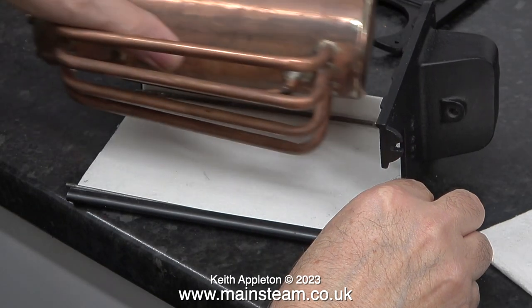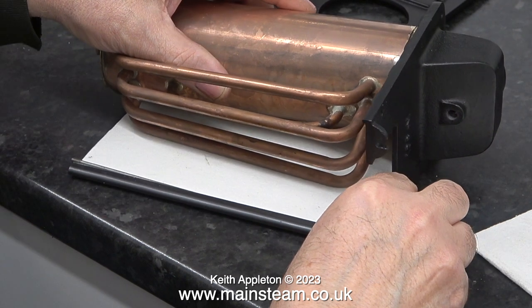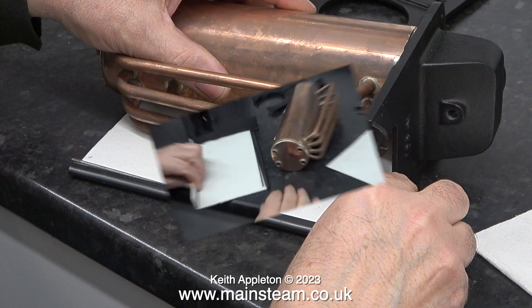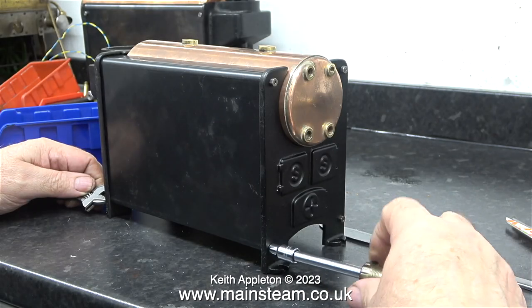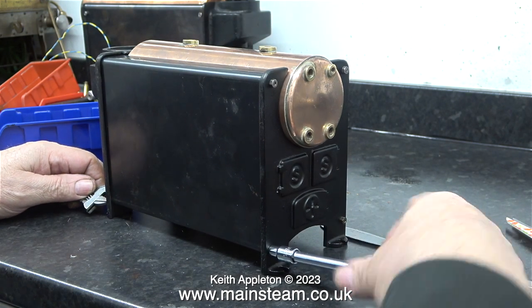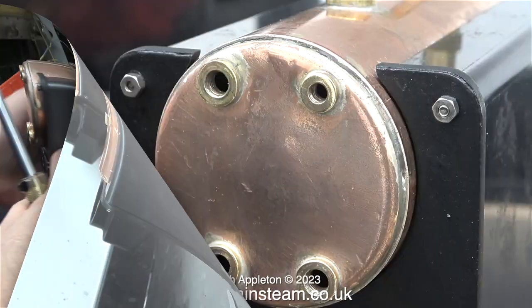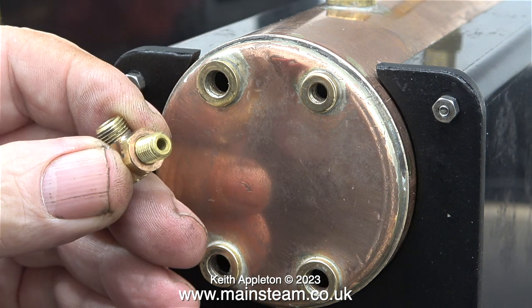The sides of this boiler are anodized, so they're fairly heat resistant to start with, but I'm fitting some heat insulation as well. This is the modern-day safe equivalent of asbestos — I think it's made from china clay. Once the boiler was loosely assembled I tightened each of the nuts to pull the end plates tight up against the side panels. I only tested this boiler to twice working pressure, which is 120 pounds per square inch of hydraulic pressure, and because it hasn't been overstressed all of the boiler bushes are aligned with each other.